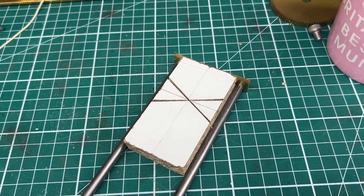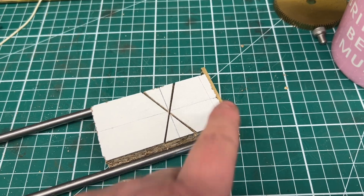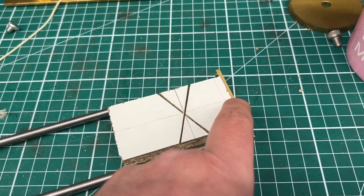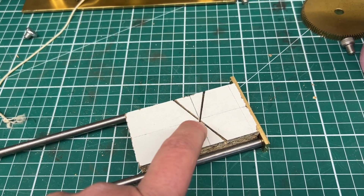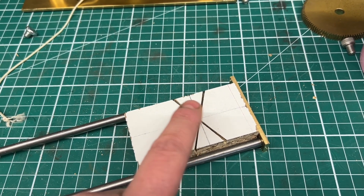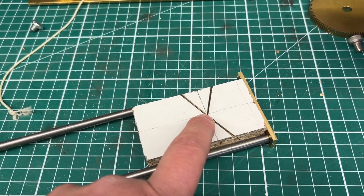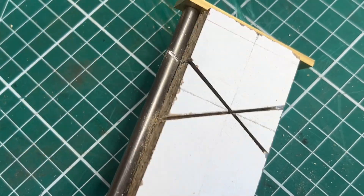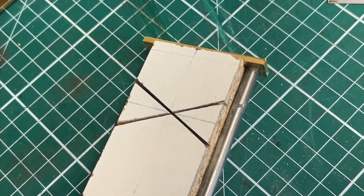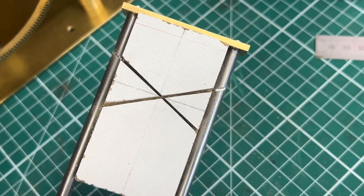This is a simple jig that I've made. I know that the distance between the suspension spring pivot and the center of the escape wheel is 61 millimeters in my case — slightly high because I'm using a slightly larger diameter escape wheel; mine's 31.6mm whereas Bernie recommended 30 millimeters. You can see now that I've got the marks appearing, which is my location of the pallets.